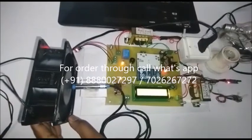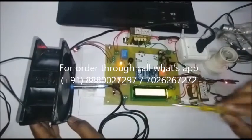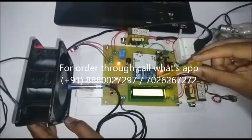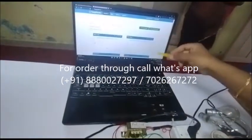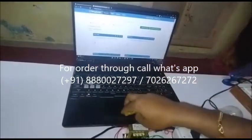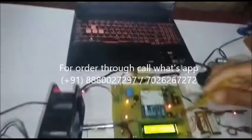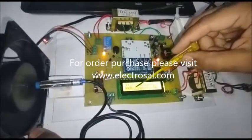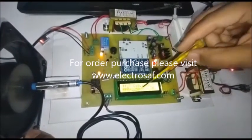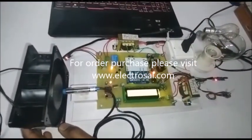See here, initially the induction motor is on. The proximity sensor is sensing the RPM. Now the project is connecting with the Wi-Fi module with the help of this ESP. Here is ThingSpeak — we can see the IoT platform where the data will be uploaded. Now we can see: temperature is at 27, current is only 0.11 ampere, RPM is right now 2250, and vibration is not occurring. First, we will see one by one scenario, then we can understand.